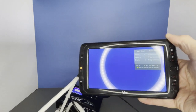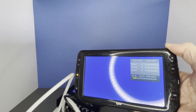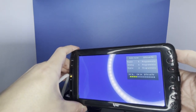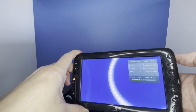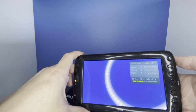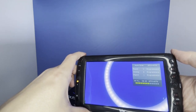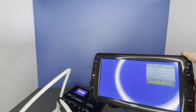So if we bring this up here, it'll take a little bit, but you'll see here it's on channel 13 physical. So remember, we had ours on, I think, channel 39 or something. So our channel won't show up until it gets up into the 30s. And then we should see a channel 39 or so. And that'll pop up with like one found for digital. You can see it sort of hangs there because it found the channel, so we found one. Now, I'm going to let it finish just because, but there's really no need to let it finish because it's literally only connected to the modulator with only the one channel in it.